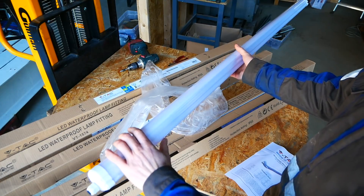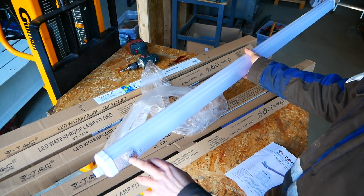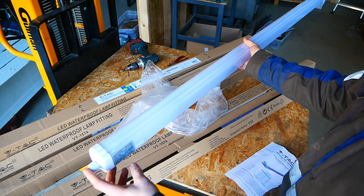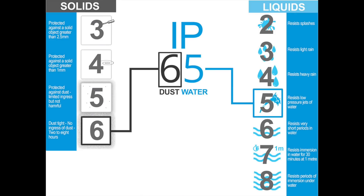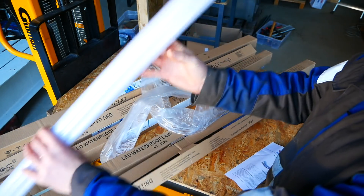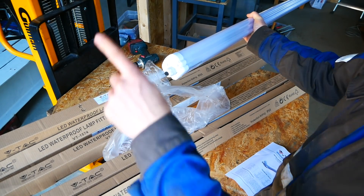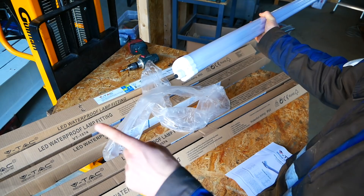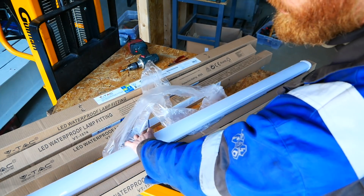I got 12 of these LED lights. They're almost 4000 lumens, so that's quite a lot. The nice thing is they're also IP65 rated for protection — so dust protected and even a little water protected. No grinding dust or anything like that can get into the wires or electronics. You can hook them up on both sides and even connect the next light so you don't have to split the electrical wiring, but that's a maximum of four lights you can connect on one main line.